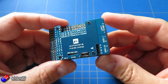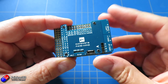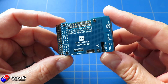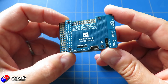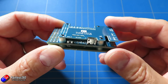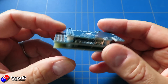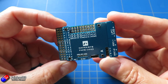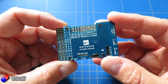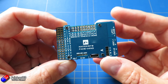So let me just very quickly talk about the specs of this thing. This is an F4 based flight controller. It has an MPU6000 six axis gyro and accelerometer, built-in on screen display, a BMP280 barometer, micro SD card black box, six UARTs - so we're not going to run out of UARTs to plug things into - one soft serial and two I2C ports as well.